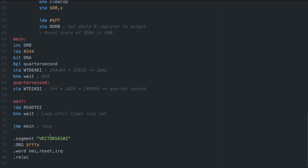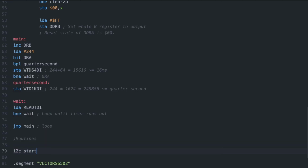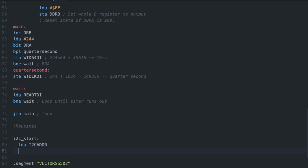The I²C address notation is one of those things that haven't been specifically spelled out in the specification manual. So on some devices, you'll find the 7-bit address noted as the byte you actually send, including the read-write bit, while others note the address before it's been shifted left. Of course, the latter is the most logical way to do it, since that shows us the literal value of the address bits themselves independent of other things, even if we have to shift it 1 bit left before we send the address byte.